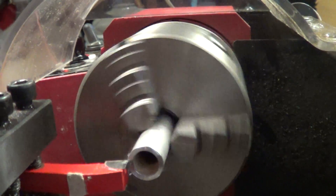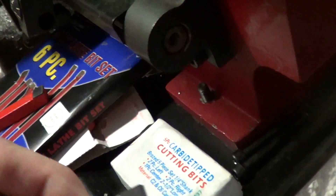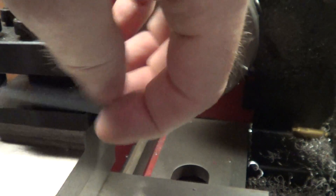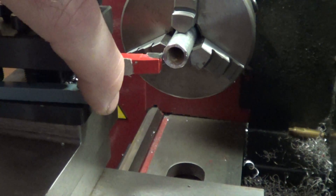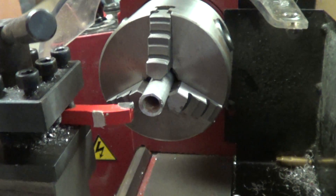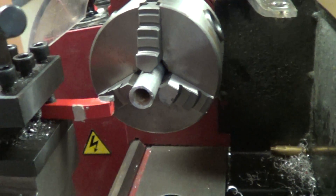If you want to machine something off, that's the 35540. Now if you use a quarter inch bit — they sell which is the 40637 — what will happen is if you put this on the tool holder, it's going to be low. So if you had to use these in a pinch, you could shim this up by a sixteenth of an inch, because that's four sixteenths and then you're at the right height. Now if you're cutting real far back it doesn't make as much difference, but if you get close in you want to have a bit that's at the correct height.